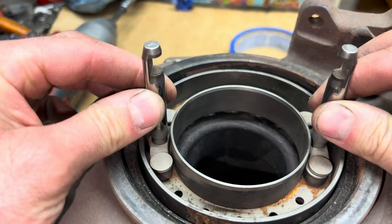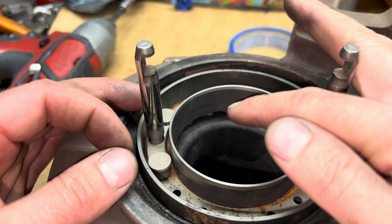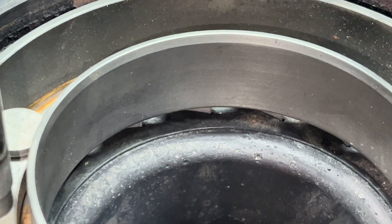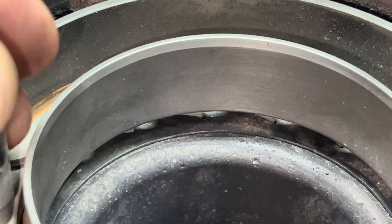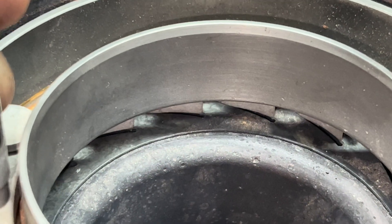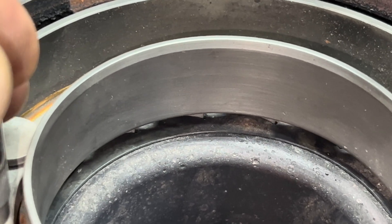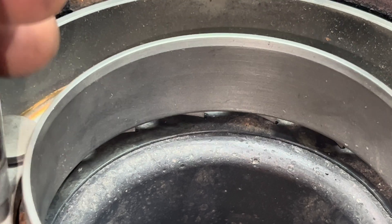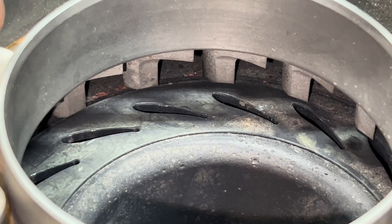Here's the nozzle dropped in — this is a bad one, and it should bottom out right here, but it's not. That's because there's already so much damage on this nozzle, so this nozzle needs to be replaced. You can see it won't go in where those fins are — the longer fins. It won't go in there. You probably could force it, but if you do that, it's not going to operate properly anyway. So in this case, this nozzle needs to be replaced.